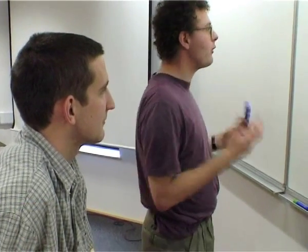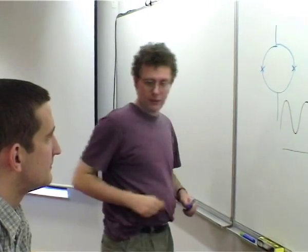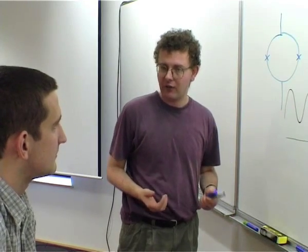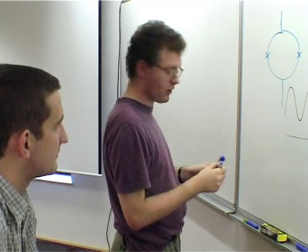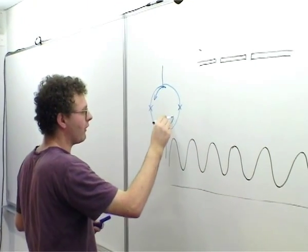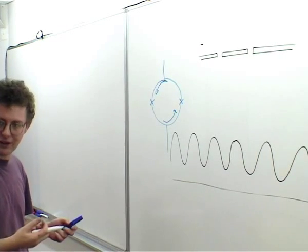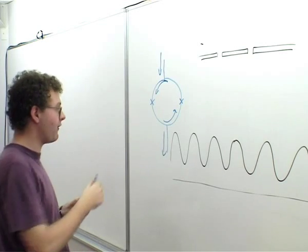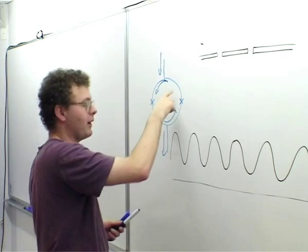There is another entirely equivalent way of thinking about this. We have a superconducting loop, and the thing we know about superconductors is they will set up a current to repel a magnetic field. So we have a little circulating current going around our loop to repel that field, and we're also applying the measurement current. What that means is that for one junction the total current goes up, and for the other junction it goes down slightly.